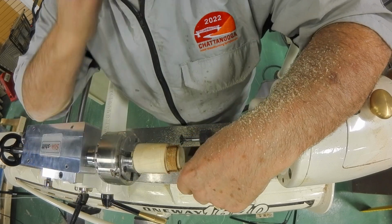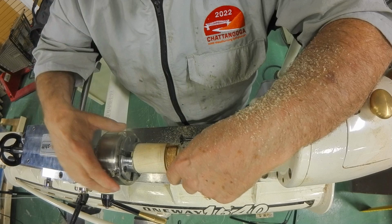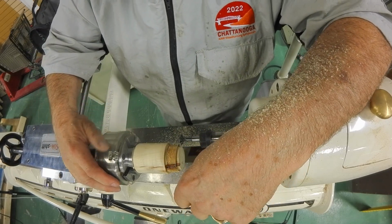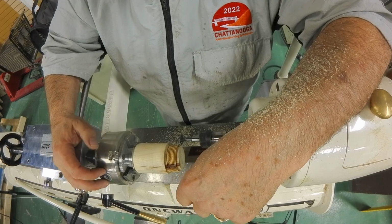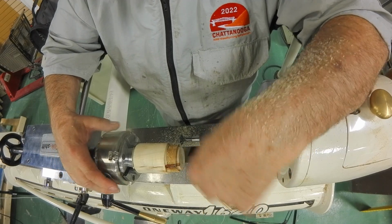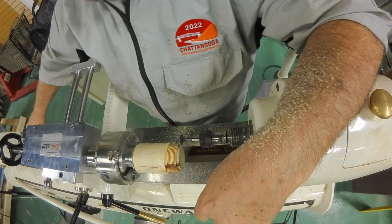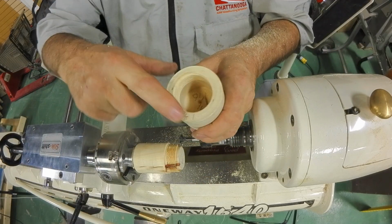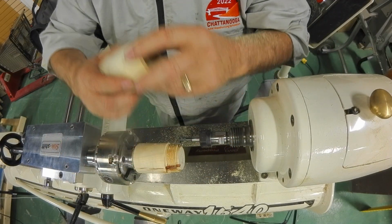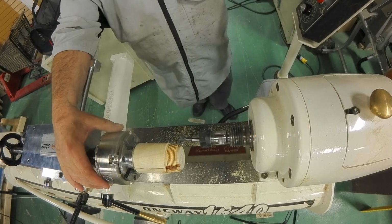We did a demo on that a couple of years ago. Great question, because that's usually what happens when you've got woods that are really, really pretty. And it's not that hard, you just have to get the threads good first, and then I usually take it off the female side because it's a flat surface, and you can take just a skin off of this surface here. Then try it, and it would let you come in a little farther, till you get a flat match. And that's trial and error. You might have to do 10 or 15 real fine cuts to get it to match.